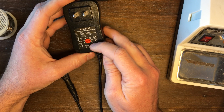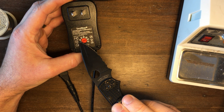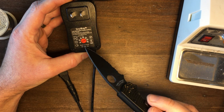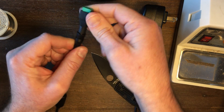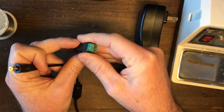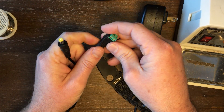They don't make too many 3 volt power supplies, but I found one that does. It's adjustable from 3, 4.5, 5, 6, 7.5, 9, and 12 volts, so we've got it set to 3 volts for this project. The cool thing is this adapter — it comes with a bunch of adapters, but this one has screw terminals on it, so we can easily take our wire, put it in there, and screw it down for a nice, easy, clean connection.